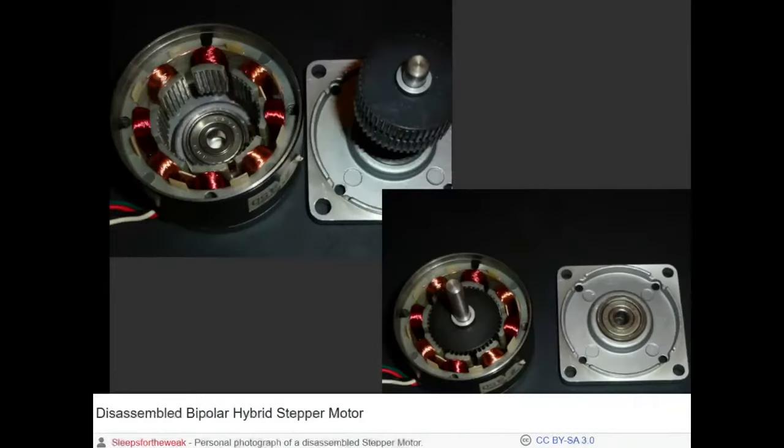And these work fine. The only issue is that they have a lot of electrical noise. The brushes eventually do go bad, and so the motors have to be replaced. I'm trying to remember what the third thing is. I think they're unreliable long term. They eventually do break, and they're sensitive to vibration.